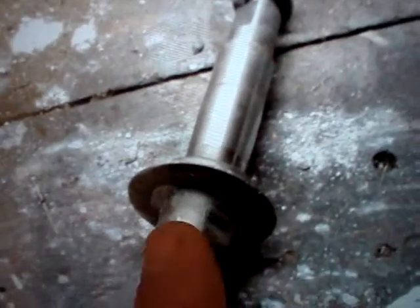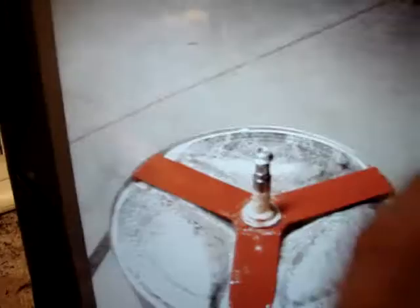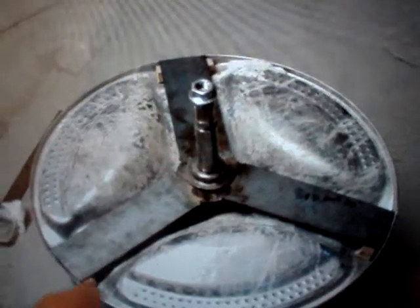This is a very hard part to do because you can't mess anything else up, because this needs to sit flat against the back of your tub basin. After doing that, I made this — it's actually quarter inch plate steel, three inches wide by a quarter inch thick.